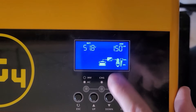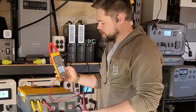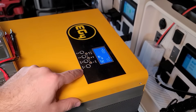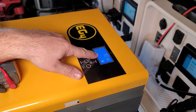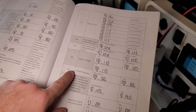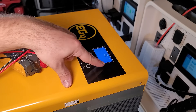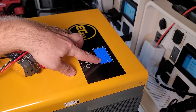There's our load at 1,500 watts — supposedly this should be doing 60 hertz now. But here it still says 119.7 volts and 50 hertz because when I went to change it in settings it would not change. To get into settings, press and hold the enter button until you hear a beep — now you're in programming mode. Starting on page 19 of the user manual you can access all programming settings. Number 9 is output frequency and we want to change it to 60, but pressing enter, switching to 60, then pressing enter and escape, it automatically reverts back to 50 hertz.